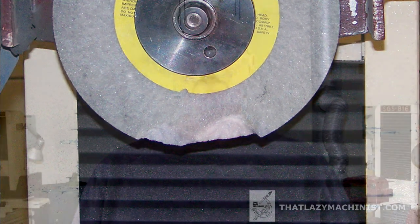Destroying it. So we're going to have to look at how to remove that wheel from the flanges. Since we've had an accident here — a crunch — we're going to want to check the mounting flanges for the grinder, and ultimately the spindle on the grinder to make sure that nothing is damaged there. Once we're sure that everything is fine, we're going to be reinstalling a new wheel, verifying it and dressing it.